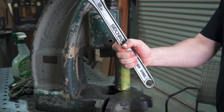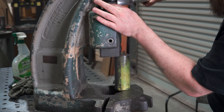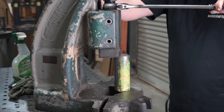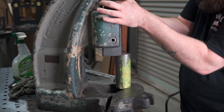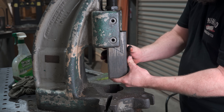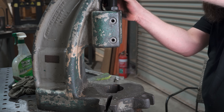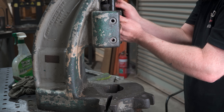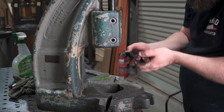So I did the ring around and I borrowed this bad boy to undo the top nut. A good portion of pulling stuff apart like this is simply finding out how it works, and this part is pretty clever. In the top of the ram there is a thread and then there is a threaded sleeve that screws down inside to keep it attached to the main screw. But it's split in half so it can be installed, because this whole contraption definitely wouldn't fit any other way.